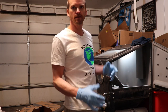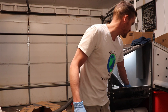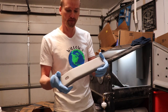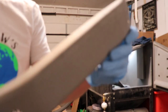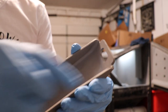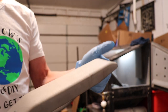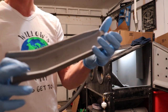I have those parts all sandblasted. You want to make sure you have gloves so you don't get any oils from your hands on the metal. Inspect them and make sure you have a nice uniform blast across the piece — no paint left over anywhere. Make sure you got your edges and inside the little holes as well. If you have a good blast, you're going to have a good coating. If you don't, it'll peel up.